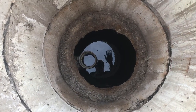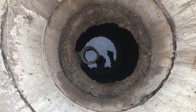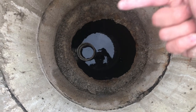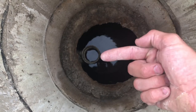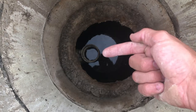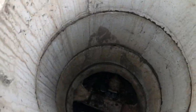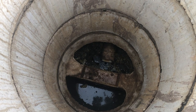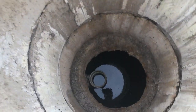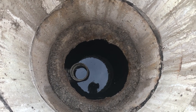This is our outlet side. You can see the water is even clearer over here because this is the effluent coming out. Right here, the effluent is at the level of where the pipe comes out of the tank — that's a little higher than over on the inlet side where my inlet pipe comes in above the water level. This side is 6 to 10 inches lower. Your tank will always stay right there at the outlet level.